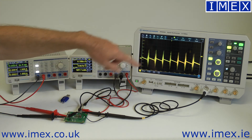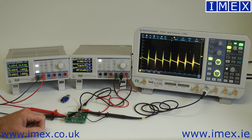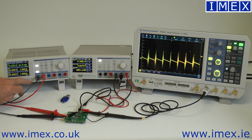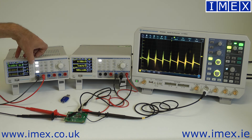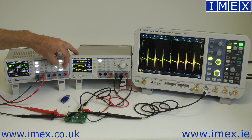At the moment we have it hooked up with an AC-coupled standard probe on the output of our DC-to-DC converter. We can easily see the ripple and switching noise coming off the regulator. By changing our input voltage, we can see the mark-space ratio of our ripple change.